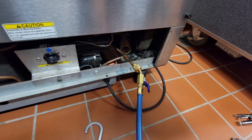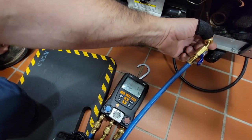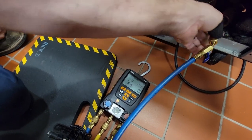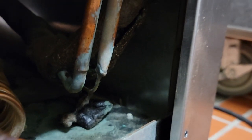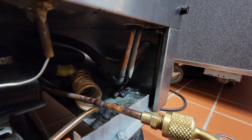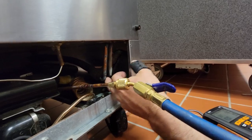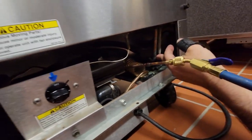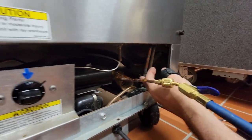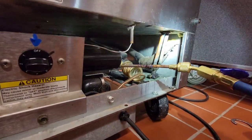It's not really dropping much. It went right back up to 152. You can see the three-eighths lines going up and the capillary tube right there. Basically what you can do is isolate it here and pressurize the wall to find out if it's in the cabinet, but we're not really to that point yet. We can't hear anything - the ultrasonic isn't on. We can take it out to the parking lot and double check, but that's not a guarantee either if it's inside insulated piping. I'm not seeing any oil, which I should if it's leaking.